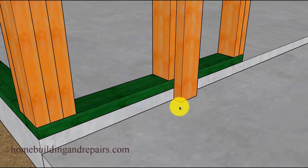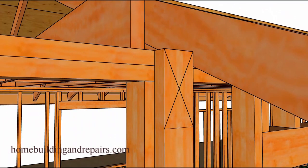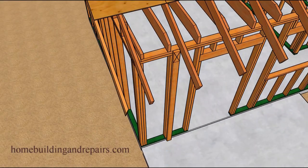In order to figure out the height of the posts that are going to sit in the connectors, you could grab a 2x4, set it on top of the patio foundation, go all the way up to the top of the wall, and then subtract the height of the beam. In our scenario we are going to be using a 4x8 beam. The quarter-inch slope on the patio slab is already there, and if we want the roof to slope a quarter inch per foot, we can use this measurement to create a quarter-inch per foot slope on the bottom and the top.